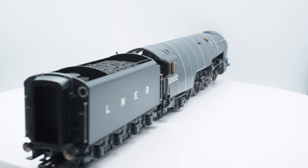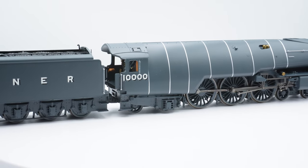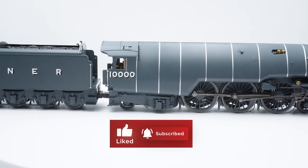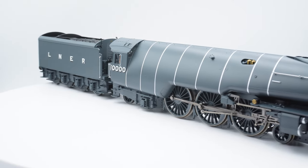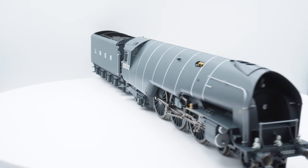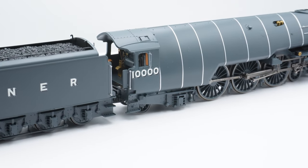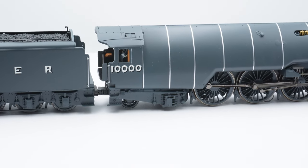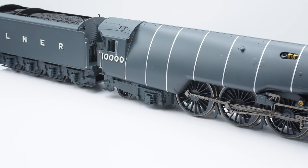In 1936, facing limited progress, the locomotive underwent a transformation at Doncaster Works, adopting a conventional boiler and three simpler expansion cylinders in a standard Gresley layout. The rebuilt engine, retaining an extra axle for a more spacious cab, featured a modified A4 boiler with new cylinders. Despite undersized valves impacting speed, it demonstrated appreciable haulage capacity.